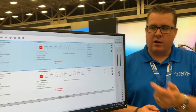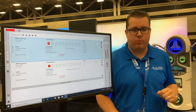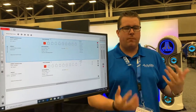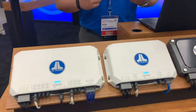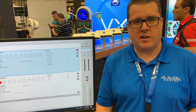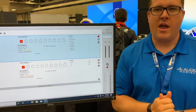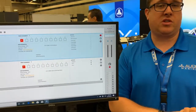Plug into the hub, click transfer network, and it'll transfer everything to the appropriate amplifier. So if we're doing systems where we're repeating the system — we do a boat, set up certain MVI amplifiers, tune it — if we replicate that system, all we have to do is put the amps in the boat, hook them up to the hub, plug our computer into the hub, hit transfer, and it flashes all of the amplifiers at the same time. That's really cool and one of the benefits of the new protocol found in the MVI hub and MVI side of our Tune software.